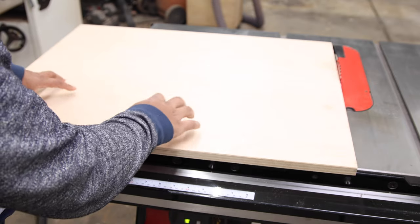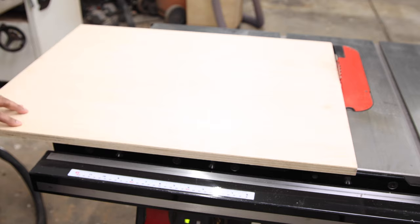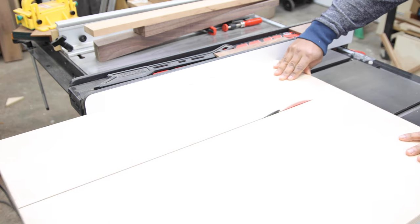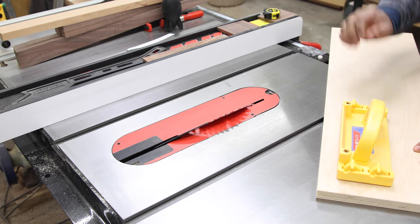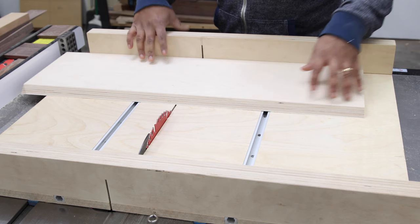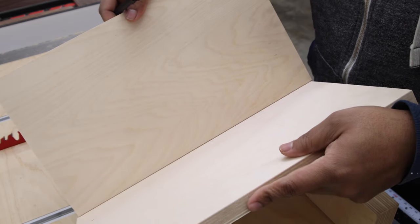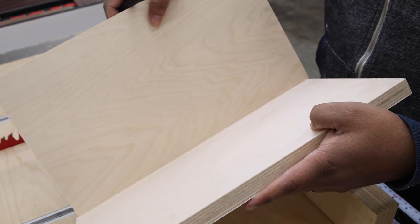So if you're going to make a jig like this, I want to make sure you're able to make it using a piece that is locally sourceable for you. The first thing we're going to do is rip this at 9 inches wide — the long way, so 30 inches is this way. We have the blade tilted to 45 degrees and we're going to take that long strip and make a miter cut. Next we're going to take this oversized piece and cut them into two even parts. With those two pieces cut at 45 degrees, they come together at 90 degrees, and that's going to support all of our miter spline cutting function.